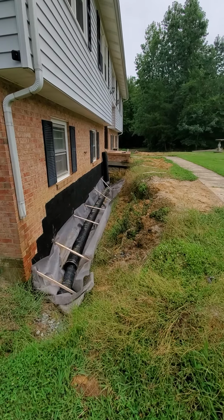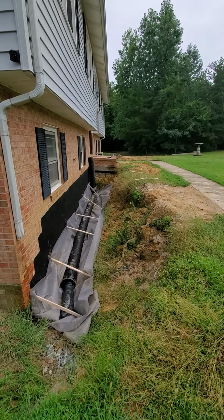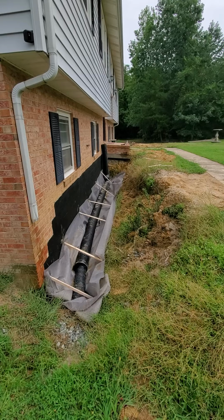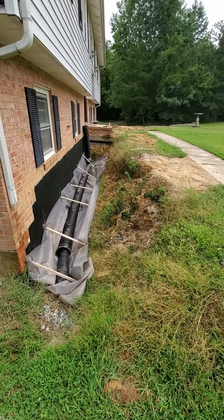so that way it just makes certain that you have less chance of soil getting down into the pipe. Only soil that's gonna go is this runoff, and as it meshes through these rocks over the years. But that 90-degree bend, that's a blowout pipe that I put in. Most people don't do that. Actually, I don't know of anyone that does that on a residential property. But I put that in so we can flood this pipe out with high pressure water if we need to later on, and blow this pipe all the way out to clear out any kind of debris or sediment and stuff.